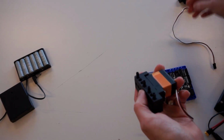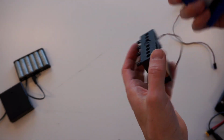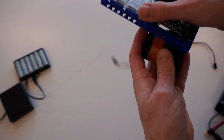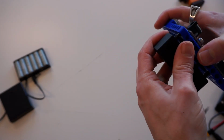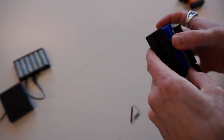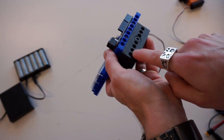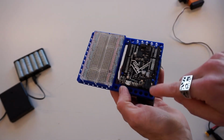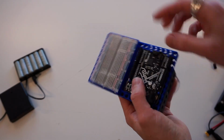And then on this one, I'm actually going to run the cable facing forwards, and the cable facing out this way, so that I can mount up on this side of the microcontroller. Now, this is key because our wheel output's actually going to go here eventually. And we need our power output to be facing away because we're going to put a big brick here. So if you put this barrel jack on this side, you will not be able to plug anything into power.